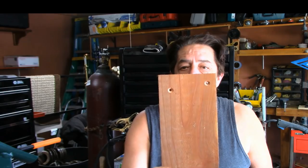This works really handy on the horseshoe projects I make because I can drill a hole in steel, turn around, and use one of these bi-metal ones to create that chamfer so that when the screw goes down it sinks in and I've got that nice smooth surface. You don't have a screw head sticking up — it just looks cleaner and better. Same thing on wood when I do my wooden signs — these are the bits I use. They're not expensive, they've worked great. I've probably made 100 signs or more using these and they still work.